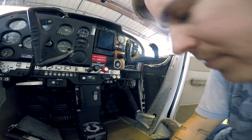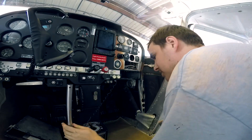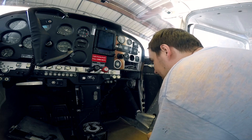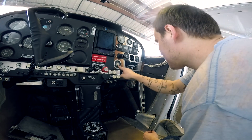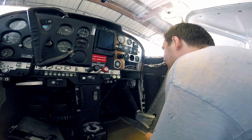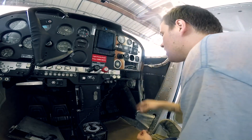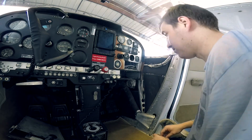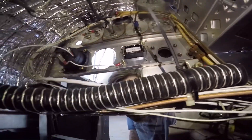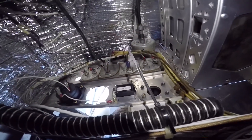I'm going to leave it like this — I might put the bolt back in, but I want to leave this off to the side for now. I don't feel the need to disconnect any of that just yet. That way I can get all of these primary engine instruments out of the way. The flap gauge is going to have to stay, but everything else for the moment can come out, including both of the Hobbs meters and all the fuel gauges. I'll use some tape and take lots of photos, labeling what is what so I don't get confused later when putting things back together. Back here is basically all of my connections for the old original gauges, plus my old tachometer and all that other stuff.